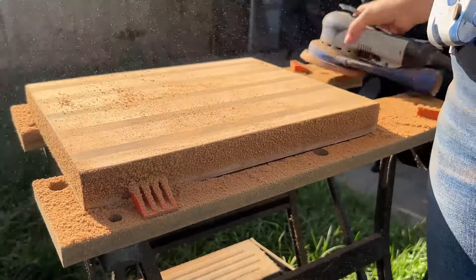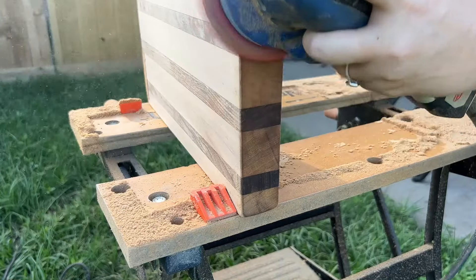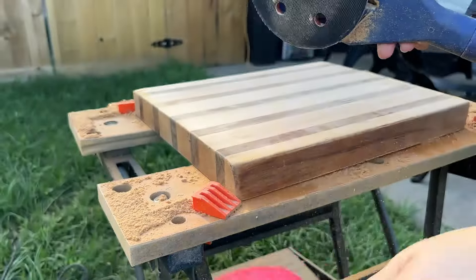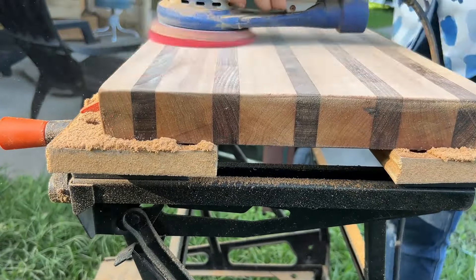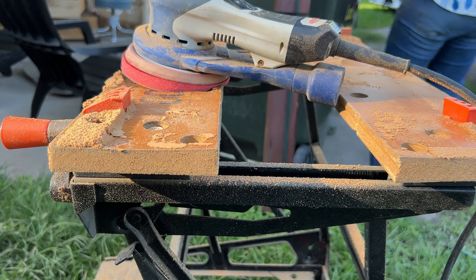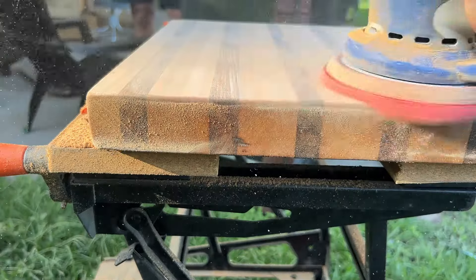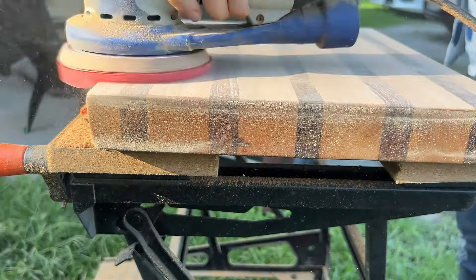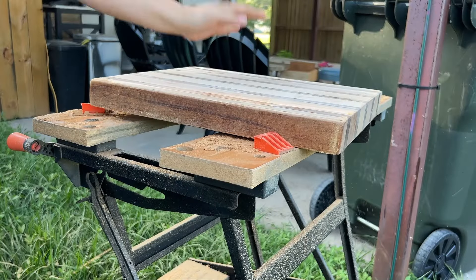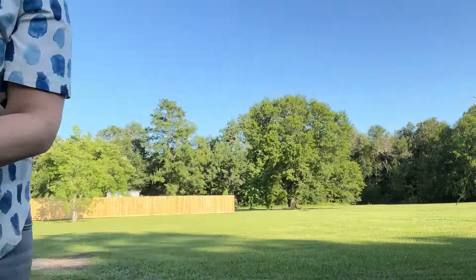Switching to that medium grit — this is the foam pad and it is looking so beautiful. And finally I switched to the very fine pad. This is like a 220 or higher grit and it will really just smooth out the rest of the piece. One of the most satisfying things about sanding is having that before and after — being able to see how rough it was before and then completely get it sanded to a smooth buttery finish. Going through the grits in that order will work. It's a lot of work but totally worth it.